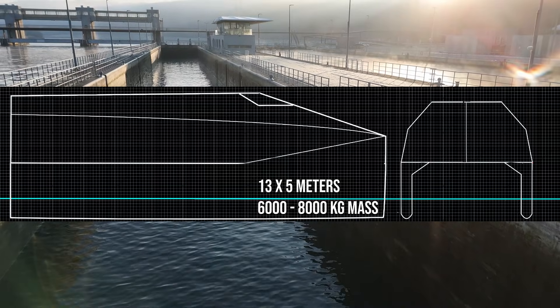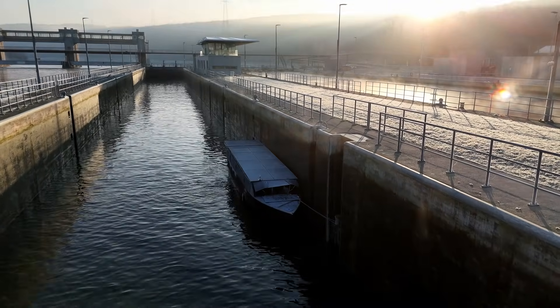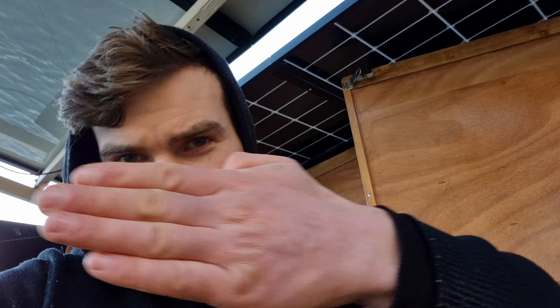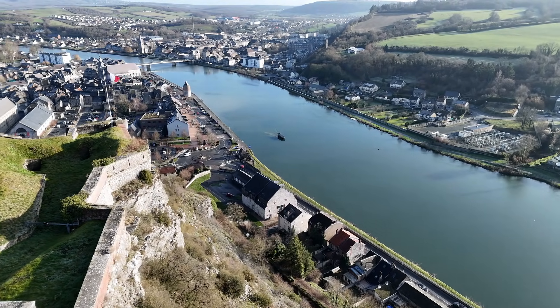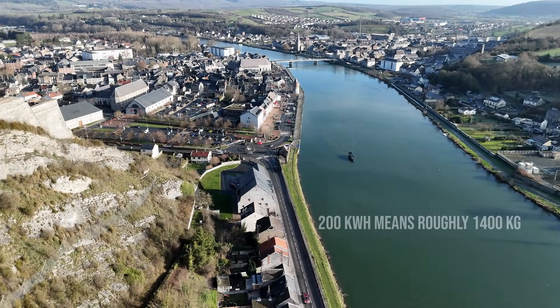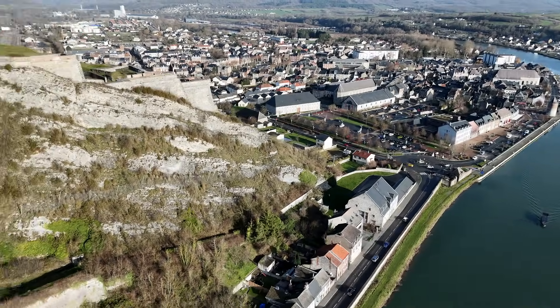But now as we have even increased efficiency of the hull, why not make it a six-ton vessel? Even eight tons — kind of lightweight, but still incredibly massive. The heavier we can make the boat, the deeper the hulls will sink. The hulls will not become wider, they will go deeper into the water where they face less resistance from the surface layer. This hull will make the Halo 13 act like a train going through rough seas, but still with that lightweight performance and barely any resistance at cruise speeds of 7 to 15 knots. With six to eight tons we can load up batteries underneath the waterline, and I think with this model the total cruise range with zero solar input would be 300 nautical miles at a cruise speed of 12 to 13 knots.